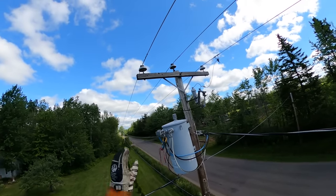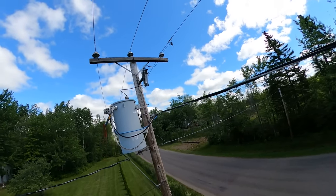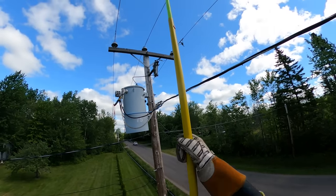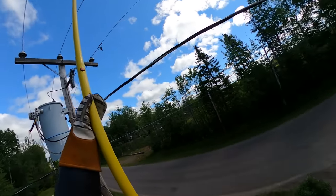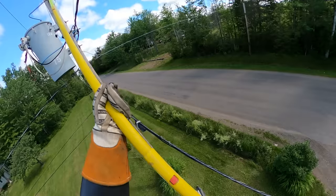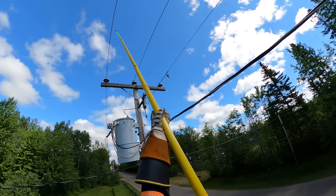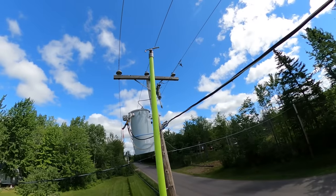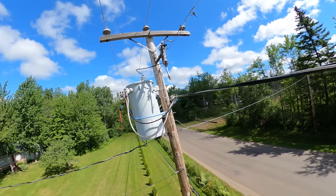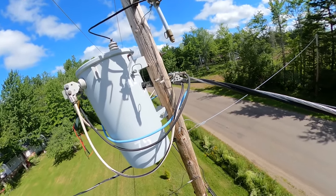As I mentioned, all of our ties on our high voltage insulators are good — no cracks in the cutout, it's the polymer type. The top side of that cutout is still energized at 7,200 volts, and the transformer has no grounds on it. There could be back-feed but it is isolated — we'll be able to operate that tap changer.